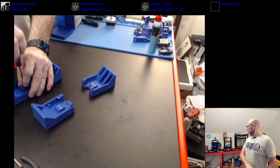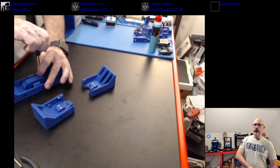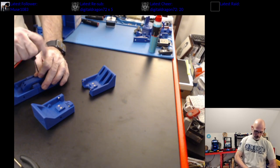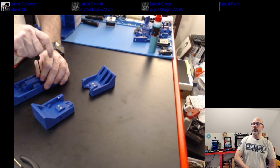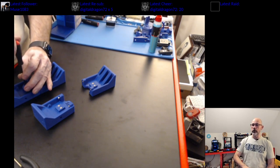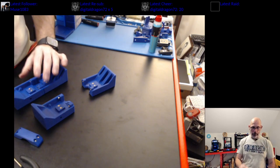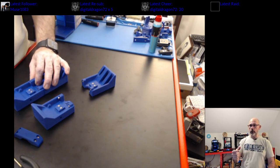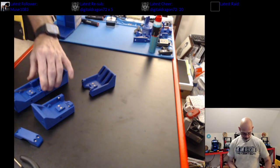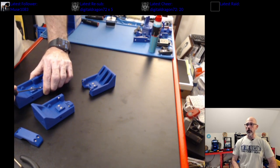So the V0, I've got an umbilical PCB. I've got the rear PCB breakout between the motors to enclose the hot area. And that is one of the best quality of life mods that you could do on a printer, because I take two screws out of the front and undo, of course, the 14-pin umbilical cable and the endstop cable, and I can take the whole hot end off and then work on the bench without having to do anything else. So yeah, that is an awesome, awesome mod.